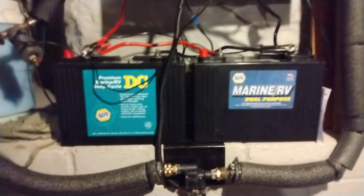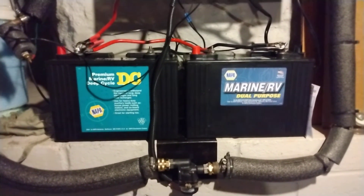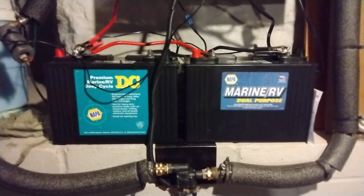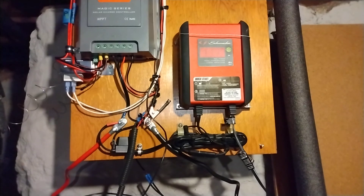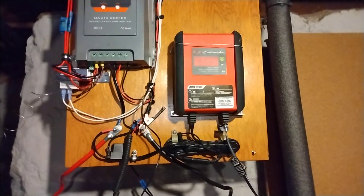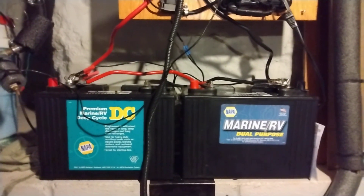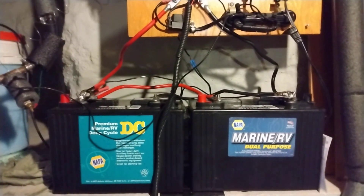I also upgraded the batteries. I know they're not lithium-ion — they're flooded acid batteries. I had one already so I just added another one. I figure in the spring I'll make the update and go with lithium-ion, but for now this is what I'm using. I also have a Schumacher battery charger; when the batteries drop down — normally about a volt a night — this charger keeps them at 12 volts without going over. As soon as the Sun comes up, the panels take over and we're up to 14 volts in no time.